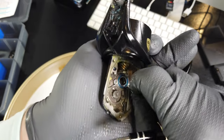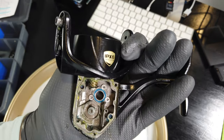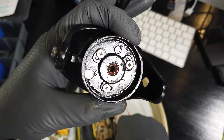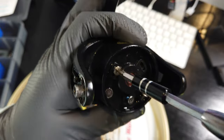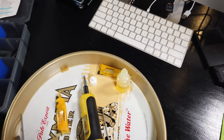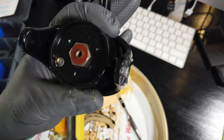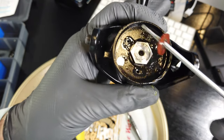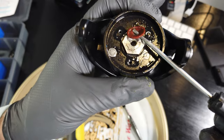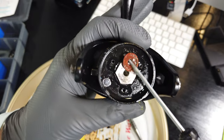You can also remove the slider retainer plate which helps guide the cross line block up and down; remove it and clean behind it if you like. Next we can attack the rotor nut locking plate. If you want to maintain factory presets, take a picture of this assembly and mark up the rotor nut to memorize its orientation. What you're looking at is the rotor main shaft seal with inverted walls — those inverted walls, when flipped over, fit into the channels cut into the rotor nut.